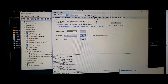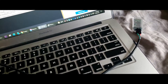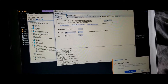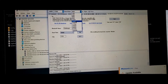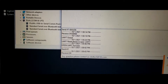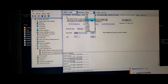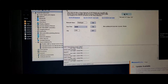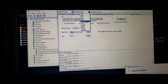You then want to close the port and power off the device — I just unplug the USB. Plug the USB back in. We can then test for changes by trying to reconnect with the unit through COM6 at a speed of 38400. Open the port and test communication with the device — we get OK. If we were to try to talk to the device at 9600, we would get no communication. That confirms we are indeed operating at the baud rate of 38400.